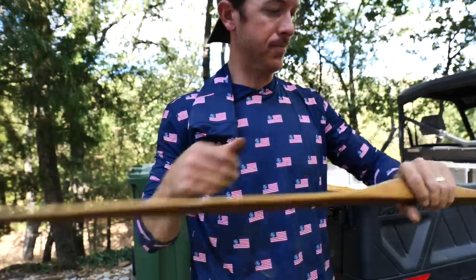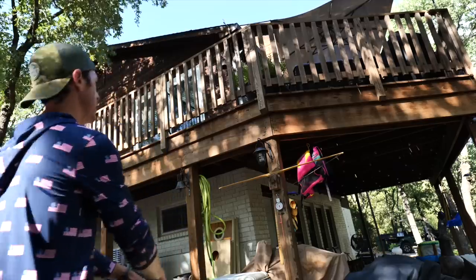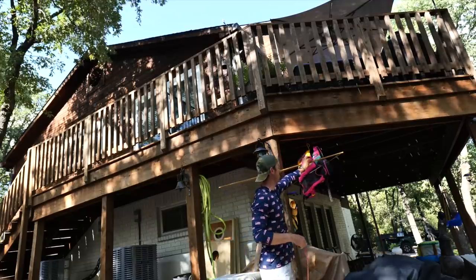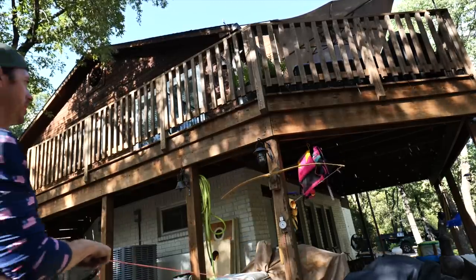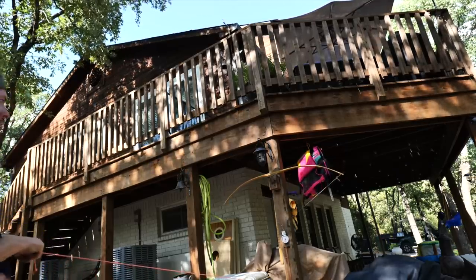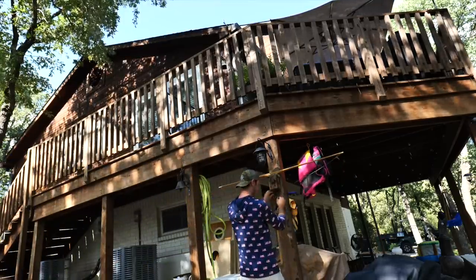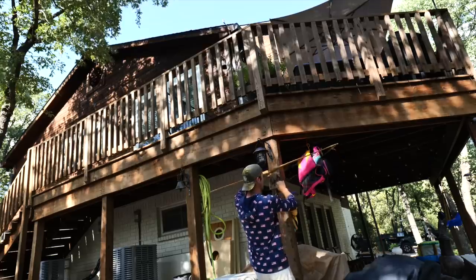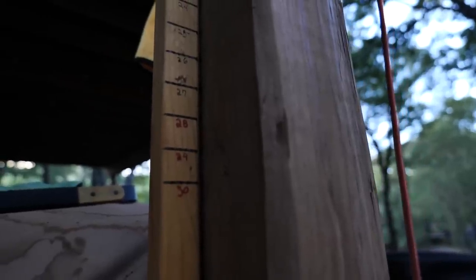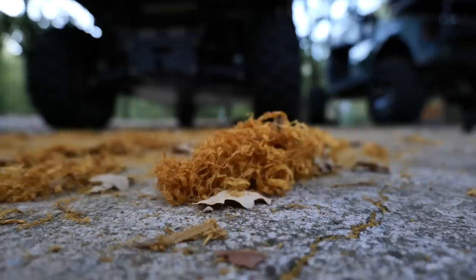My audio cut out on this clip for some reason, but as you can see I've got the left limb flexing really nicely. The right limb still has that little stiff area because of that knot I've got to work out. But the bow is bending to 45 pounds at 25 inches, so we've got 3 inches to go and I think the weight's gonna be perfect — should be just around perfect at 28. We just got some shaping up to do.